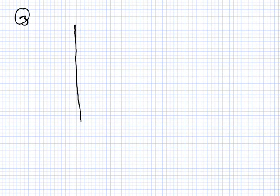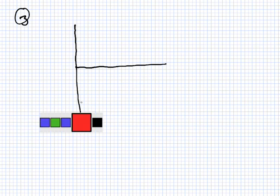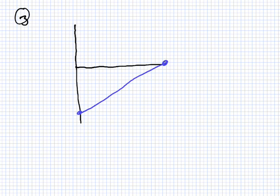This one now is our first one with a strut. So there's this piece of wood here. I think it goes all the way to the edge. Now the distances are 40 centimeters. Well, I'm going to split it straight away into 2, 20 cm and 20 cm, and then this piece here, 50 cm. Actually, from Pythagoras, if this is 40 and this is 50, you can use Pythagoras to get this one. It will end up 30.